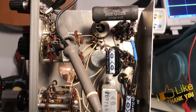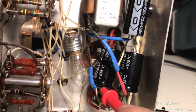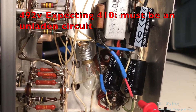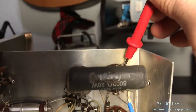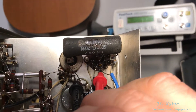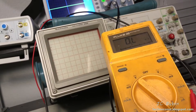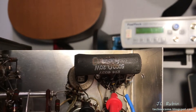What we're going to do is take a look at the rectifier and see if we've got any DC coming off of it. I'm seeing about 492 volts DC coming out of the rectifier, so we're definitely getting DC out of there — both sides of this capacitor right here. DC does make its way into the 6CL6. The plate voltage is good. It would seem as if I have lost the 5000-ohm 20-watt resistor, as it is reading open across this. I'm going to double check, but I think I found the culprit. This one has finally gone.